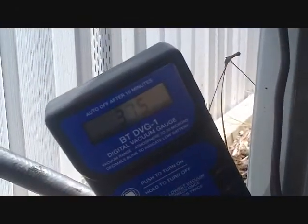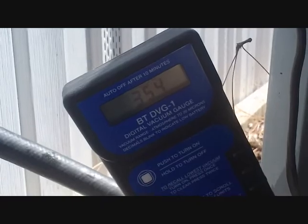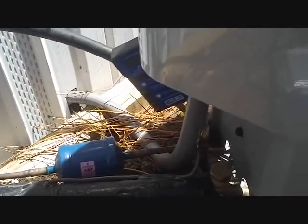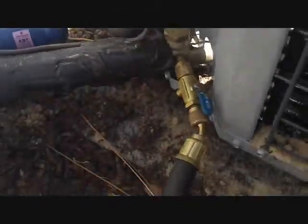It's been about a minute and I think I figured out the problem. We had the hoses set up but nothing was pulling down. The issue is the S-Man being used as a vacuum gauge — two problems: the hoses going to the S-Man aren't vacuum rated, and that sensor is always exposed to contaminants. It would need to be cleaned profusely every time and it was muddying the readings. Now with the new gauge we have 220 microns and it's only been on for two, two and a half minutes.